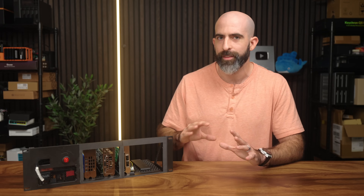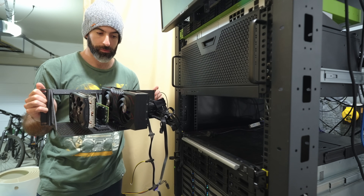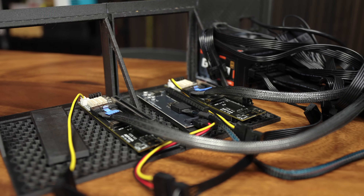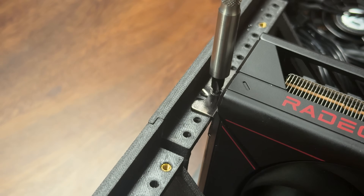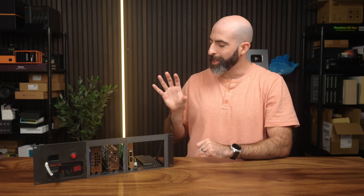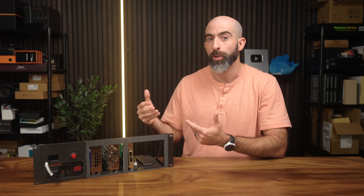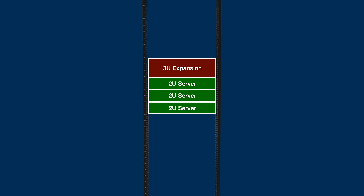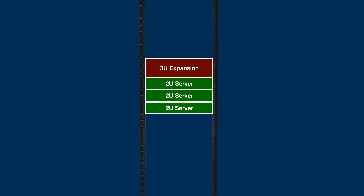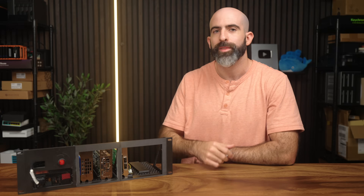The other thing — and I say this about all of my designs — is that it can be improved by a whole lot. While it is sturdy enough to hold some big beefy cards and can be customized for different uses, the double-sided tape and lack of standard PCIe slot screws is definitely a little jank. Overall though, I love this thing. Another benefit I didn't mention is that this can house cards from multiple systems — so if you have a cluster, you could deploy this to hold all the cards from it. Assuming you have three 2U systems and this expansion unit, that's 9U total, but if you deployed three 4U systems to accommodate the cards in each unit, that's 12U. Look at that — saving space.